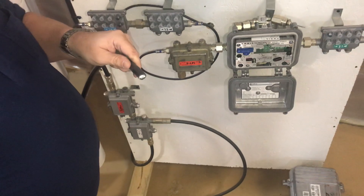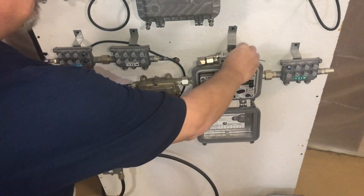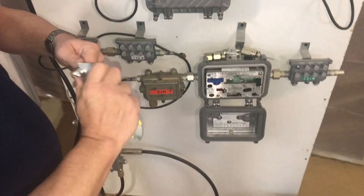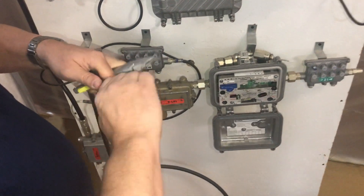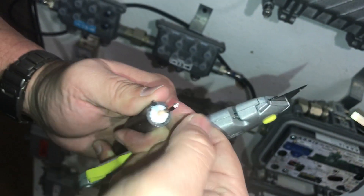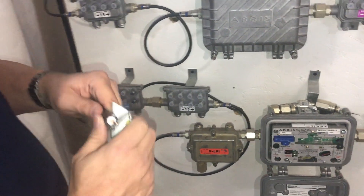I'm going to do it the dangerous way and go clear down to the center conductor. I don't want to touch and score the center conductor because that will affect my channel. I want to get it just enough through the dielectric so that I can turn it and you can feel it break loose — that means I should not have touched the center conductor.